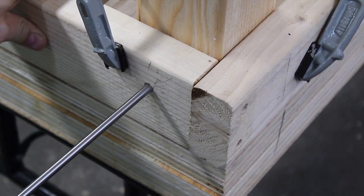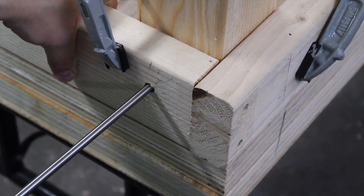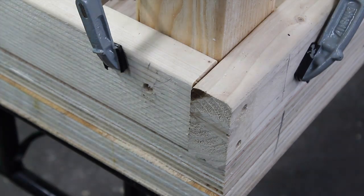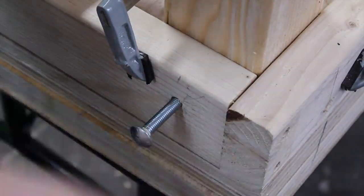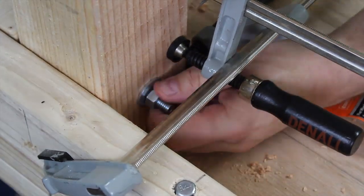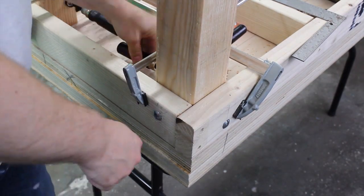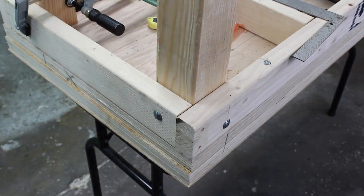When you're boring, make sure you use a really long boring bit — in this case about 12 inches long, a 3/8-inch bit from Home Depot. Make sure you pull out the boring bit frequently to clear it because the 4x4 in this case is really wet. As you see it blew out the back — just cut off those splinters so they don't get caught in the threads of the carriage bolt. Now jam that carriage bolt in, put on your washer and nut. If you're like me and forgot to put the washer on before the nut, just take it right back off, put the washer on, and put the nut back on. Do that for each of the corners. Once done, you should be able to take the clamps off and that leg should have no play in it — otherwise tighten those bolts a little bit more.